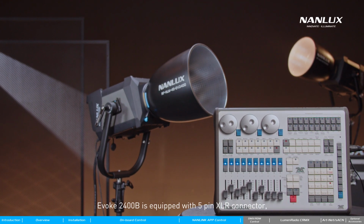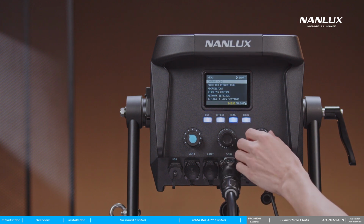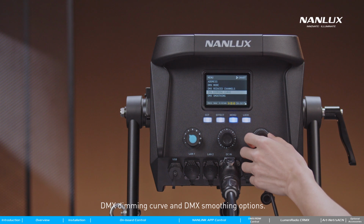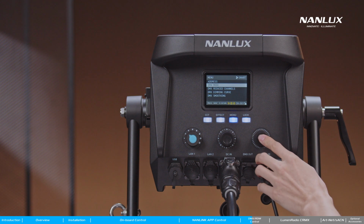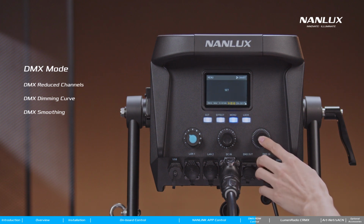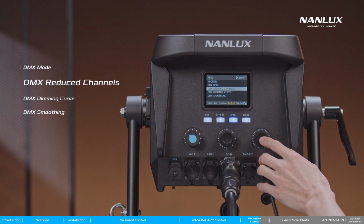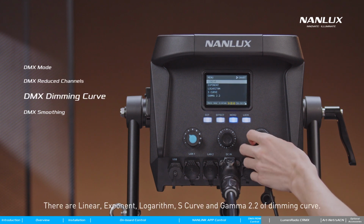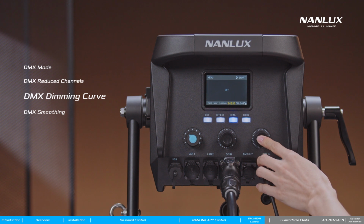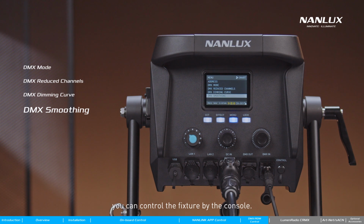Evoke 2400B is equipped with a 5-pin XLR connector for connecting with a console via DMX connection cable to achieve accurate control. Evoke 2400B also has DMX mode, DMX reduced channels, DMX dimming curve, and DMX smoothing options. There are CCT 8-bit, CCT 16-bit, and Ultimate DMX 8-bit of DMX mode. There are linear, exponent, logarithm, S-curve, and gamma 2.2 of dimming curve. After these settings, you can control the fixture by the console.